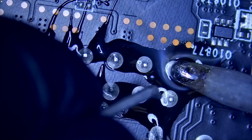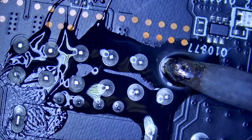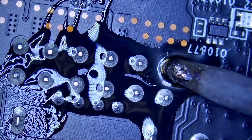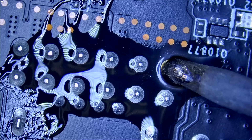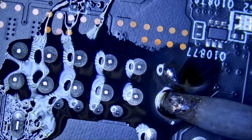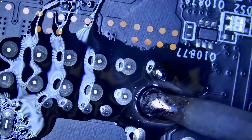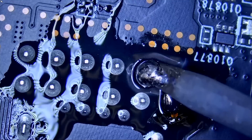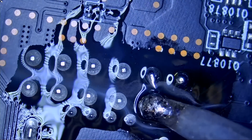So let's apply low-melt solder. See, that board takes a lot of heat. Unleaded solder did not even feel anything — I have my soldering iron on that joint and I can tell unleaded did not melt yet. That's how thick that board is. The board is probably saying, 'Why are you tickling me?' We're going to add more low-melt solder. Now the board is absorbing the heat, so it becomes easier to apply low-melt solder on the rest of the pins.